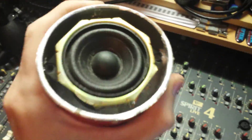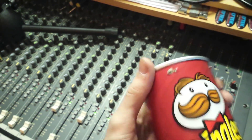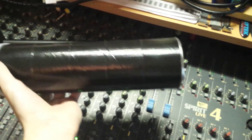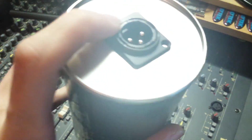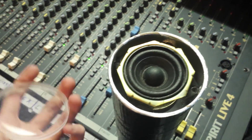There's the speaker fitted in the can - there's very little movement to it. There's the XLR installed. I think we're good to go. What I'm going to do is wrap a bit of gaffer tape around this just to stiffen it up. I've gaffer-taped around the edges - it just so happens to be five pieces of gaffer tape, the perfect height of Pringles cans edge to edge. There's our XLR connector again, not going anywhere, very stiff - and it's not even glued. The lid even goes on perfectly so you can put it away.